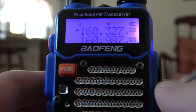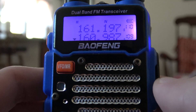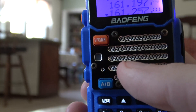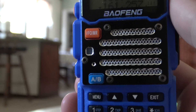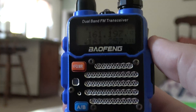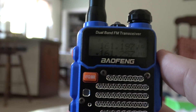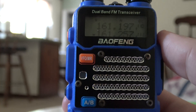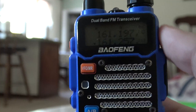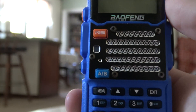So that's how that works. That's converting all of the ones I wanted for the area to narrow band. I wanted to put all of the railroad channels — all the standard frequencies and all the narrow band frequencies in — but this Baofeng only allows 128 channels, and that would have been a total of 192, so obviously that wasn't enough room. I had to sacrifice and just stuck with what I thought I needed. I plan to do a railfan trip soon to see how this behaves on the narrow band. Hopefully it will be louder and clearer.